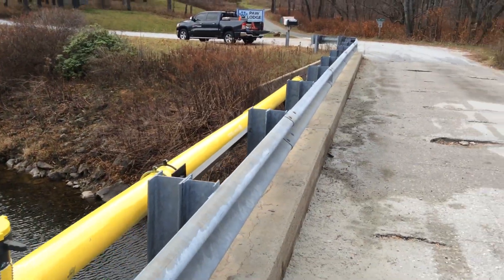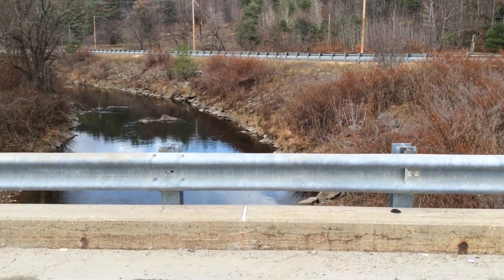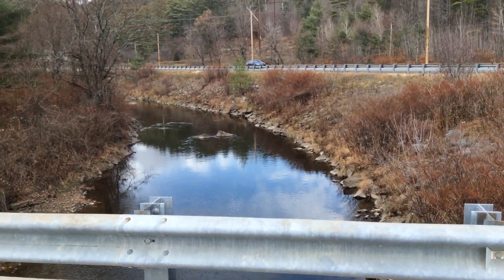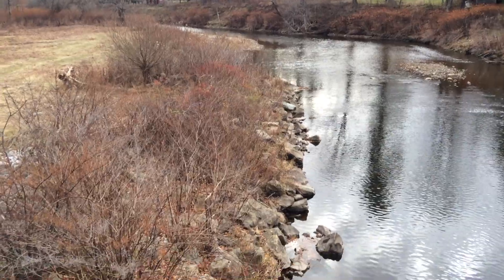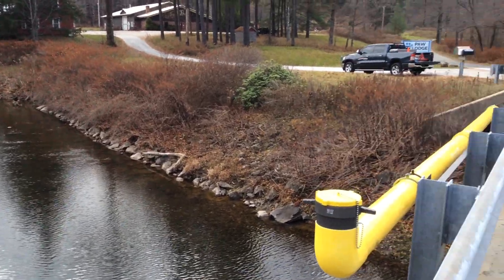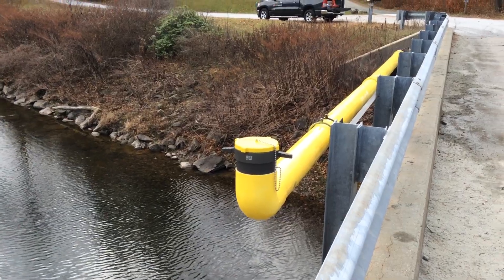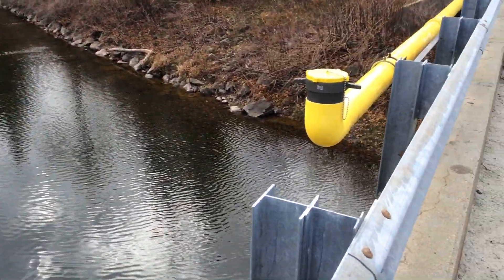There's our swivel and then the suction head on the downstream side, which is good. This river does not top over — it does get high, but it doesn't top over. And you don't see a ton of big storm debris; there are a few things, but no big trees. So it is a good candidate. There is six feet of water — when we deploy this thing, there is six feet of water over top of that strainer. Tons of water here.